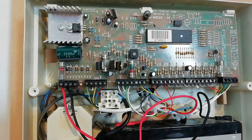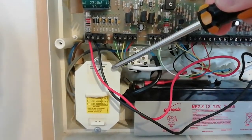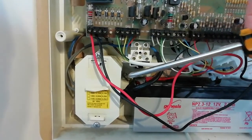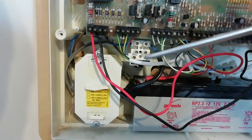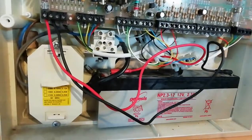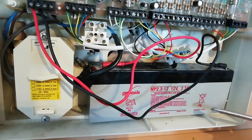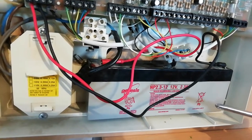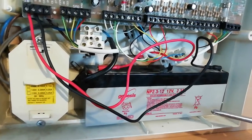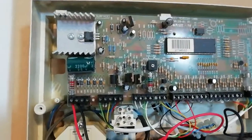Let's have a look at some key things within this unit. Each alarm system will be slightly different but overall they're quite similar. This is the AC power. We have no AC changes to make in this project so we can stay away from the AC terminals — and make sure you power off the unit before you open the panel. Next we have the battery. You can check the health of your battery: when you remove the mains power, if the unit stays powered on it's because the battery is working. If the unit doesn't stay on, the battery is faulty. You can also test it with a multimeter. This battery is actually faulty and needs to be replaced, otherwise the system won't work in a power cut.